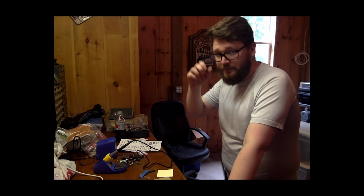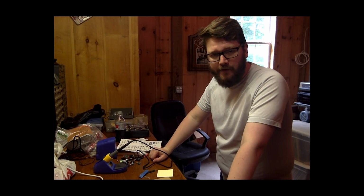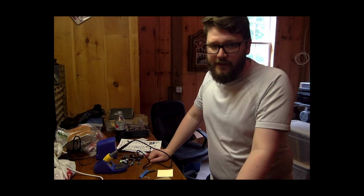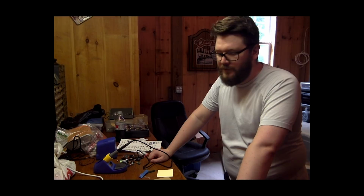Well, when you're interfacing with a Eurorack with any other gear, it's worth knowing that the Eurorack signals coming out of your synthesizer are much, much hotter than line level. So they generally need to be attenuated before they hit your interface. And the same goes for inputs. Typically you want to amplify your signals coming in if they're at line level, or really boost them if they're something like a guitar or a microphone. It's just about getting it up into the same voltage range. The voltage, you know, peak to peak on Eurorack is considerably higher than your sort of half a volt to a volt peak to peak that you get with line level.